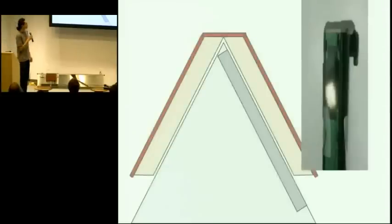And for this prototype, one way we improved that situation was I just took these sensors to a belt sander. And it turns out you can grind away quite a bit of that circuit board before the thing stops working. And that was enough to get us within about 9 millimeters of the groove, which is okay for most books.